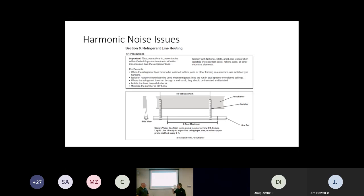Okay, when we come into the house, just what I want to say is this, guys. Think of how they're building homes today. Carpeting is not really the norm anymore. It's hard surfaces, engineered flooring, tile. So when you bring that line set, you drill the side of your house, and you're coming over the block wall, but then you've got to get underneath that floor joist. Okay, we want to scoop down below that.